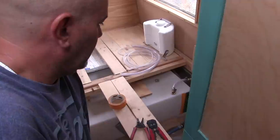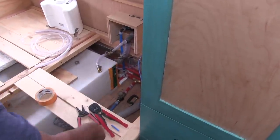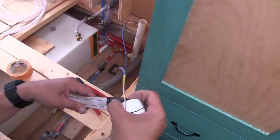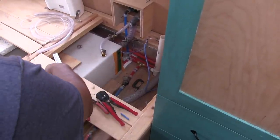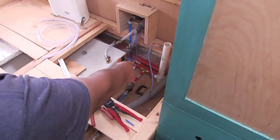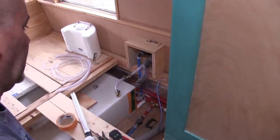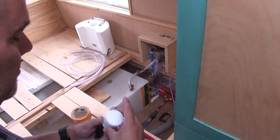While we're doing this, we can fix our problem. Which is? Okay, so the early tank monitoring system with the measuring tape used that tube in order to accommodate this big long thing that you can't cut down. In order for this to allow water to get up in there, it needed to vent at the top. That induced a different problem: whenever the pump would turn on, it would start sucking water out of the tank here, but also would suck from this side since there was a vent. This side was easier to get water out of, and it induced air into the line, causing all of our things to spit like that. So you turn it on, and the way to get rid of that problem is to snip this off and put this cap on and seal it up for good.